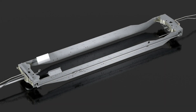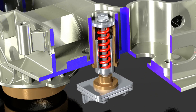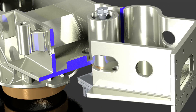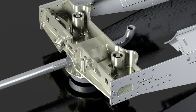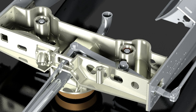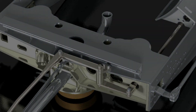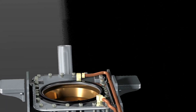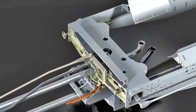The middle section of the locomotive is secured by a total of four bearings, damped by springs against swinging and rolling. The control of the driving direction by means of rods is also conducted over the center pin. The same holds for the actuation of the dewatering of the cylinders. The tubes from the water tank to the boiler are realized via flexible hose connections.